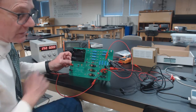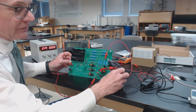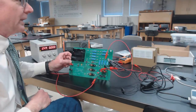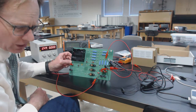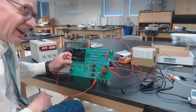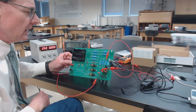When I depress this switch, current is going to flow through this circuit and start to charge up that capacitor. We're going to measure the potential across the capacitor to try to get our RC time constant, and from the RC time constant we are going to try to determine the capacitance value. I'll have a separate video to walk you through some data analysis ideas for this part of the experiment, and a theory video or two as well.